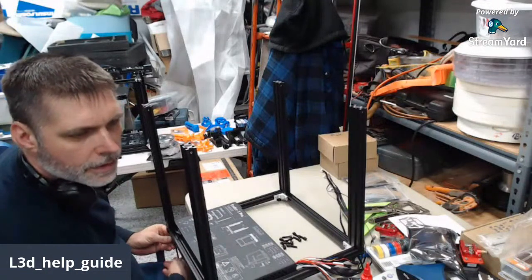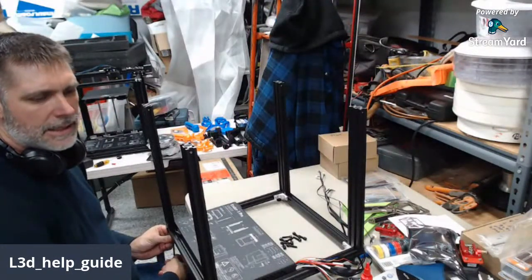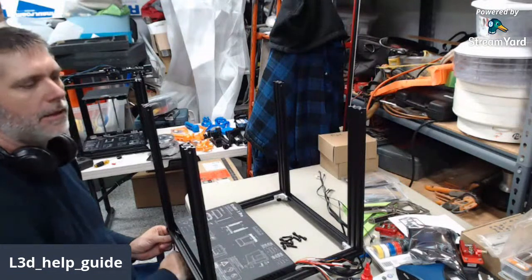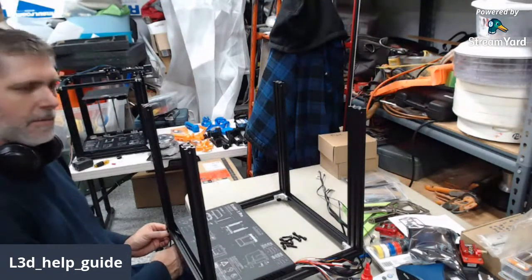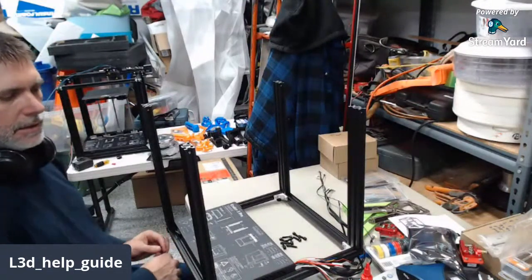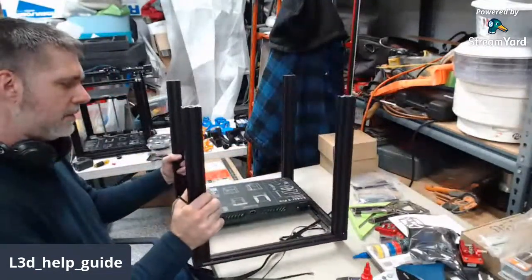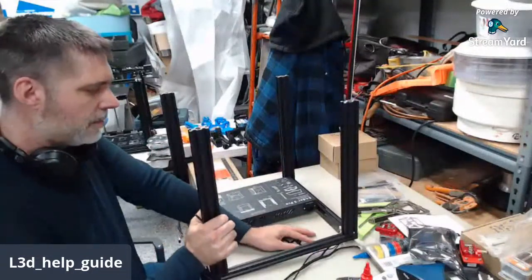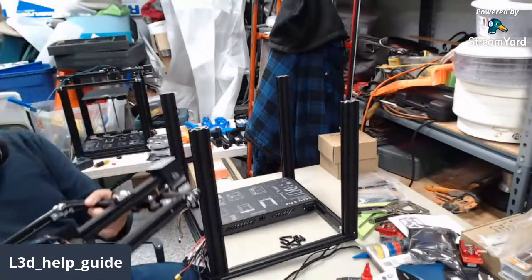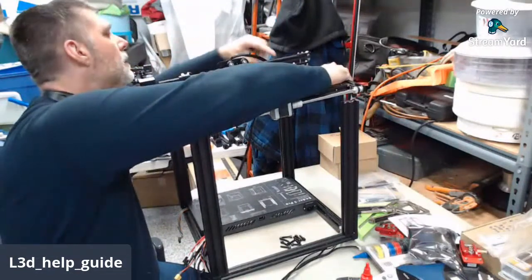Yeah, so putting it in with the 2 turns loose and tightening it, that helps. But what you'll find over time is the teeth in the Bowden coupler will dig into your PTFE, and it will actually allow a void to form there. And I've done it with extreme amounts of added compression to test, and still over time the PTFE wallers out and you get a micro void. I have a couple of detractors of it. There are people that say, "Oh, you don't have to do it." Um, no, you don't ever have to do anything. But I have an animated video coming up that a guy did for me that illustrates what I'm talking about, and it shows that you will definitely have it happen over time. So there's that.